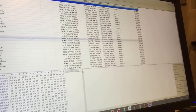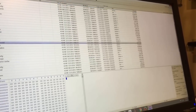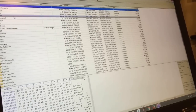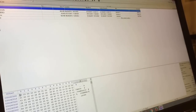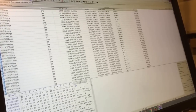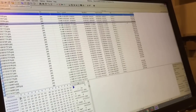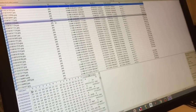Just finished, and we have the whole Android file system here. There are many different folders but we're just looking for photos and videos. We'll click on 'media' and then 'zero,' which brings up everything the phone has stored in media. We're just looking for the DCIM folder — click that, then the camera folder, and there are all the pictures the customer saved. Looks like we have several hundred pictures. This is the customer's personal information so I won't go any further, but you can see this is a successful recovery from an LG G4 that was stuck in a boot loop using the chip-off method.